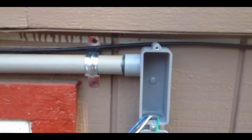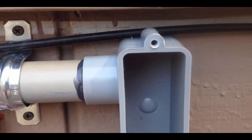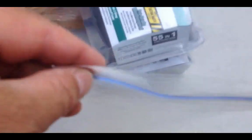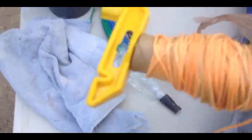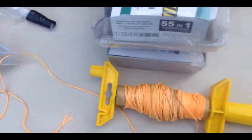I'm going to show you how you can snake wire all the way down conduit without having to have all the fancy tools. It's called chasing the rabbit. The first thing you're going to want is just an ordinary ziplock bag, then you're going to want some string, preferably on some sort of a roller so it'll roll easily.